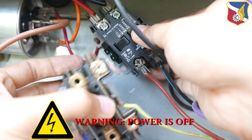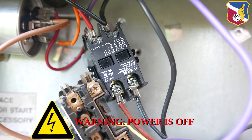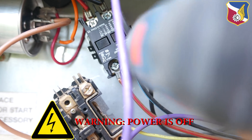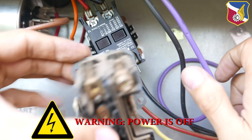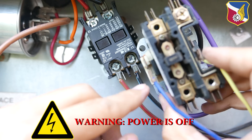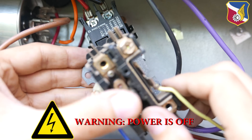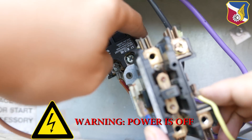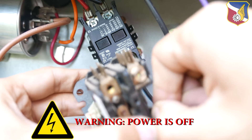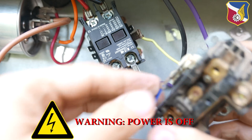Now there's still the yellow and the blue wire. I'll go ahead and connect the contactor on here first before moving those two wires. Now the yellow and the blue wire — it doesn't matter which side they connect to as long as they're connected to the opposite side. So this blue will go here and this yellow will go there. These two wires are coming from the thermostat. Since the orientation is yellow on the right side and blue on the left, we'll follow the same orientation. There are two tabs — it doesn't matter which one you put it into as long as you put it in one of them.